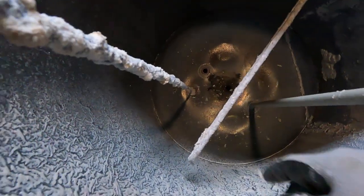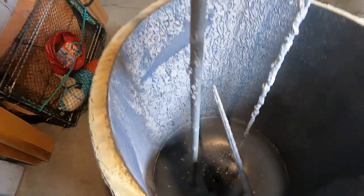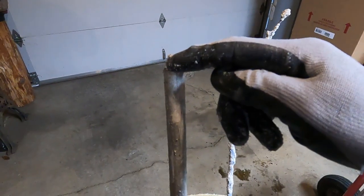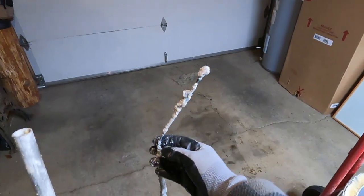A little bit of scale here, but here we got our top element. And then this is our cold fill tube, which looks in nice shape — cold water comes in this way and all the way down, and it fills into the bottom of the tank. And here's the anode rod — you can see that it's been doing its job.